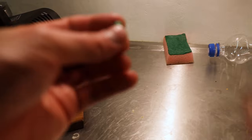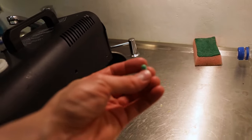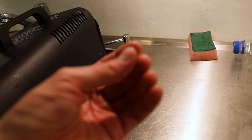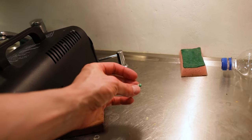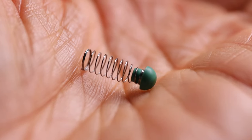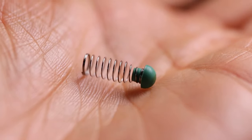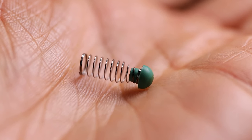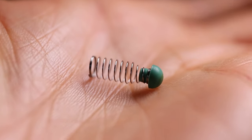This piece was blocking the liquid motion. I think it is swollen up so liquid can't penetrate it. This is the back pressure valve. It didn't cause any harm when I removed it, so now the liquid runs through the pump.